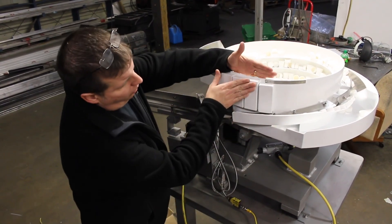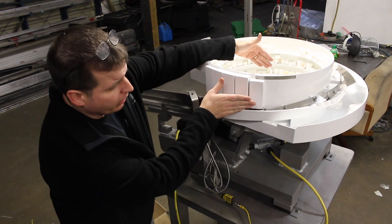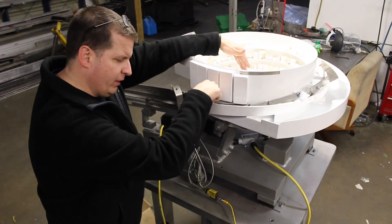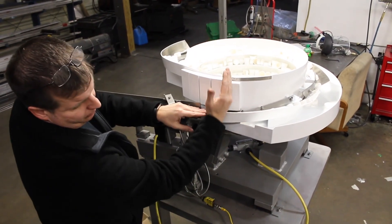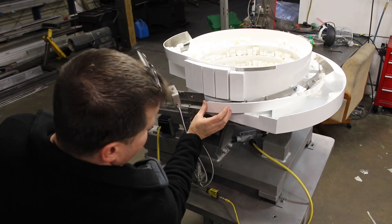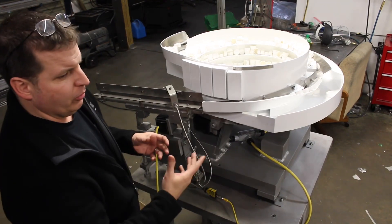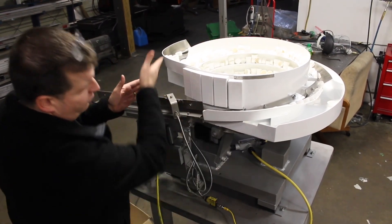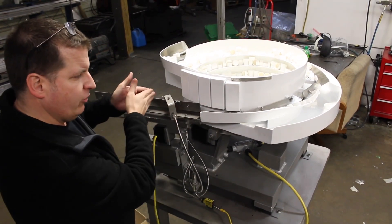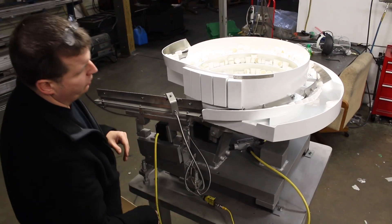Off of your bowl wall, you're going to have what we call the off-center line and off-tangent. The off-center line is going to be from the center of the bowl to the center of your part — that gives you the distance from the center of the bowl to the direct center of the running surface of your part. Your off-tangent is the distance from that center line, how far off-tangent we come. You want to try to keep your off-tangent down to the bare minimum when ordering your bowl, because the further you get off-tangent, the more it wants to drive radially and not straight, and the parts get sporadic.